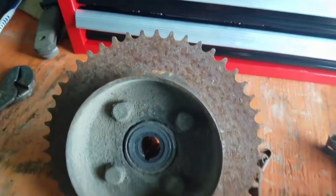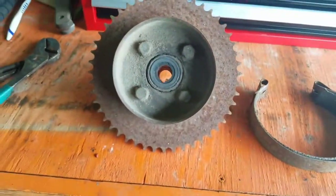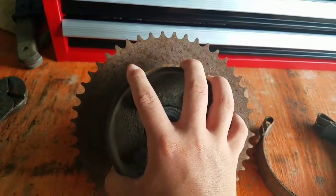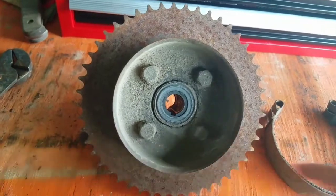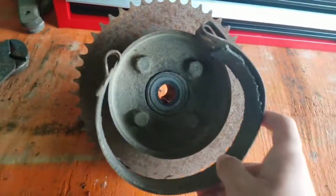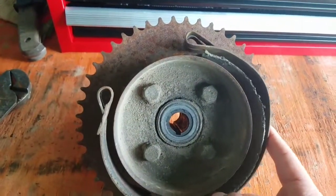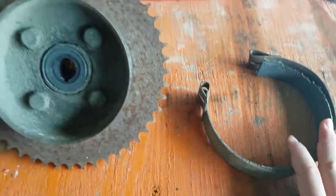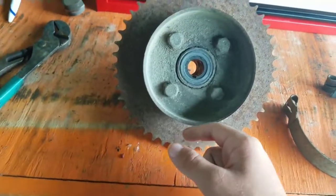I was looking up all the brake bands I could find and they were all different sizes — four and a half inches, five inches, four inches. I'm glad I figured that out because I had to measure the drum. It was four and three quarter inches, and you don't want the brake band to be the same size as the drum because it would just sit on it and create friction all the time.